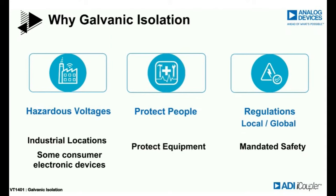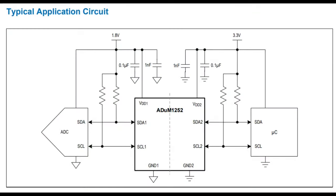Secondly, medical devices. A lot of medical devices are in literally messy situations — lots of liquids and fluids, things getting kicked over. You don't want anything to accidentally connect a power supply to the sensor that connects to somebody's EKG. They often have high sensitivity requirements; you don't want a lot of noise. And then also regulations, especially for power equipment — there may be a legal requirement to keep grounds and power supplies separate. This is where you want truly electrical separation, not just a ferrite bead; there's literally no electrical connection between ground and power on either side.